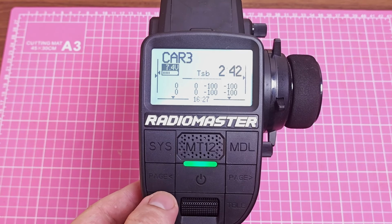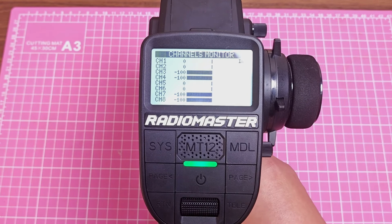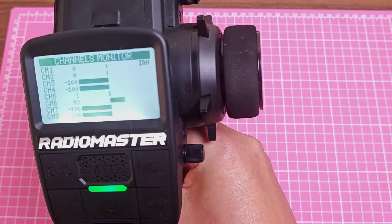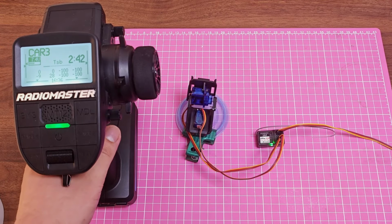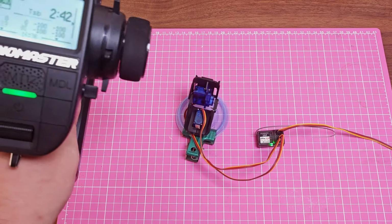So now if we go over to our channel monitor here, we've got channel 5 and 6, we should see some movement there. I hope it's not too hard to see with the lighting. Maybe if I move it a little bit over here, you can see we are moving there. So here I've got a really basic setup for demonstration purposes. I've got a little simple 6-channel receiver here, and my pan and tilt mount is wired into channel 5 and 6. So now when I move the controller, you will see that the pan and tilt will pan.